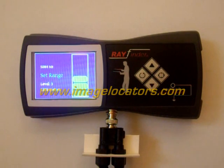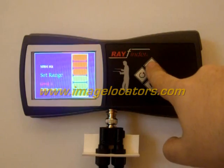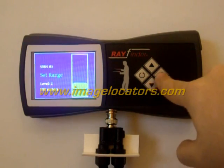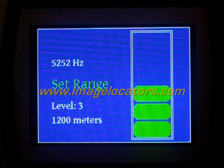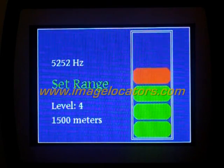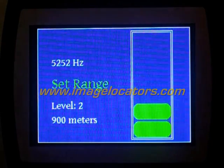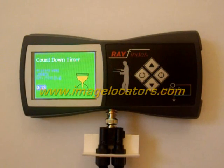Input the scanning distance, from 7 range levels. When using higher range levels, smaller targets respond also. With lower range levels, responses from larger targets remain, while smaller targets fade. Wait for the ground charging process to complete, and then start scanning.